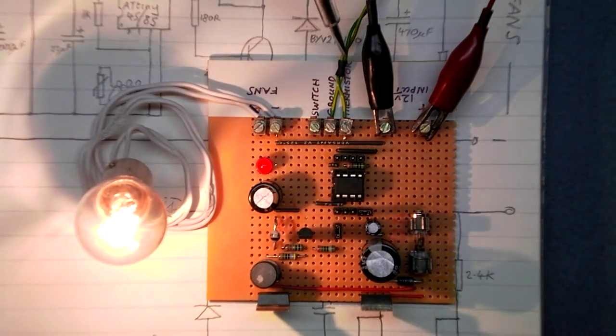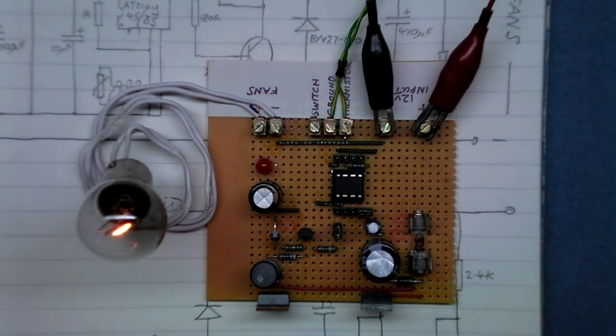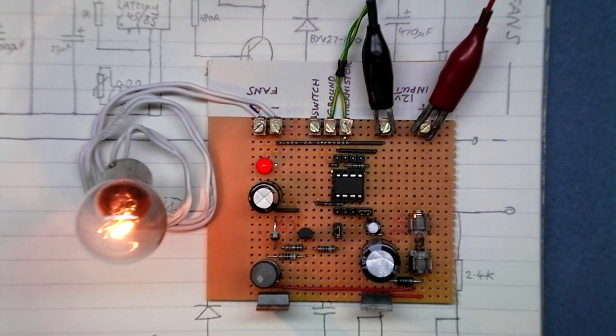There's a thermistor that senses the hot water feeding to the shower head. I've just attached that to a pipe that feeds the shower head. And there's one single switch which controls the mode of operation, just a momentary push button switch, and that switches it from high to low to off, and it gives you the facility where you can program the fan speed